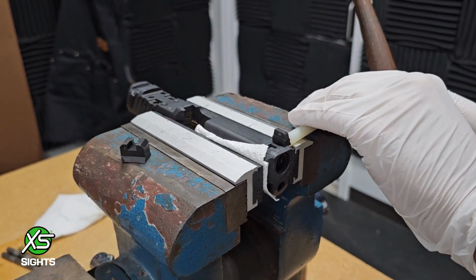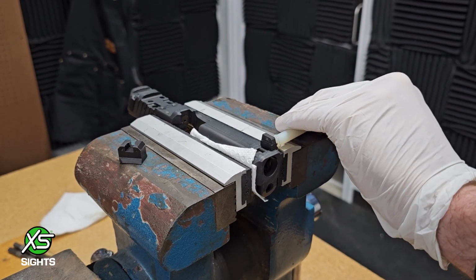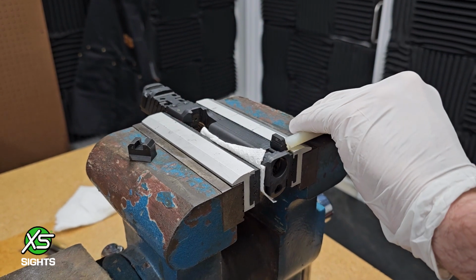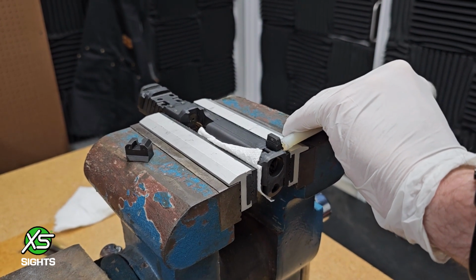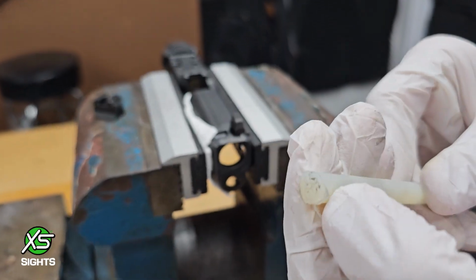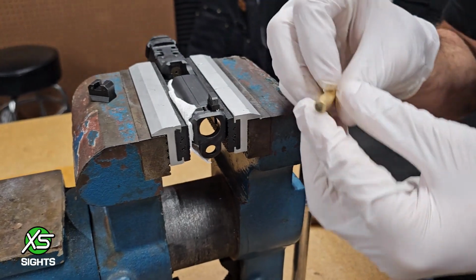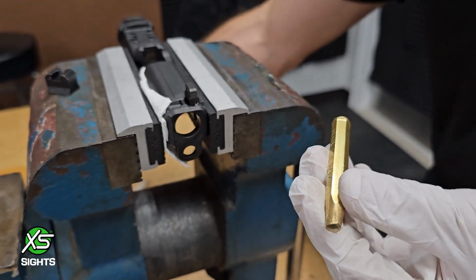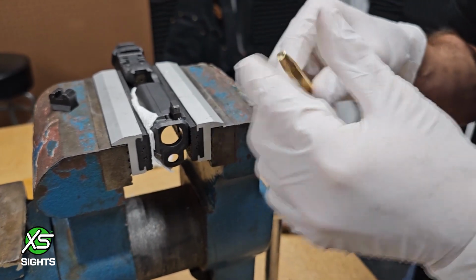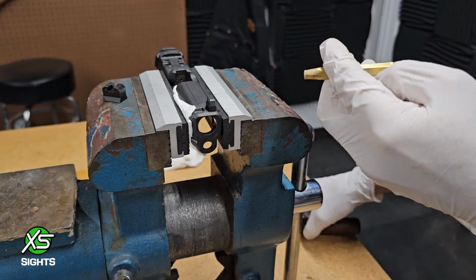And this is where you question if you need upgraded punch. So one thing you'll notice with the nylon, the harder you hit it, the more you damage the end of the punch. And this is where upgrading, I'm using a brass here, but I also have steel. Go next to the brass. It's tearing up the nylon too much, so we gotta go one material up.